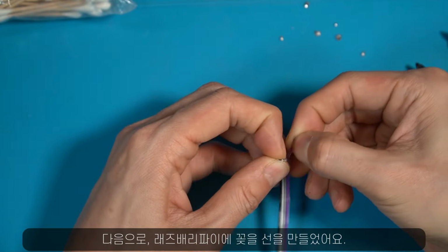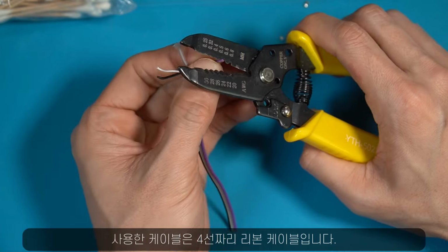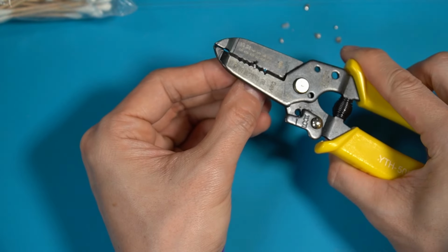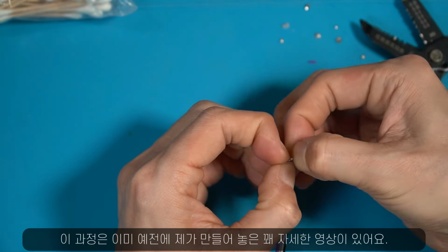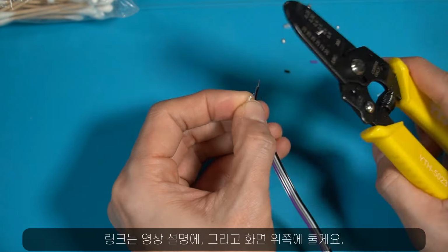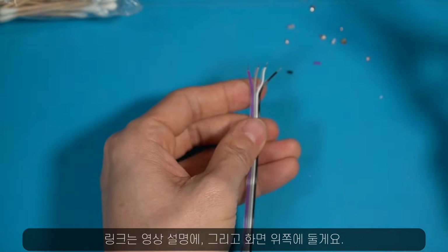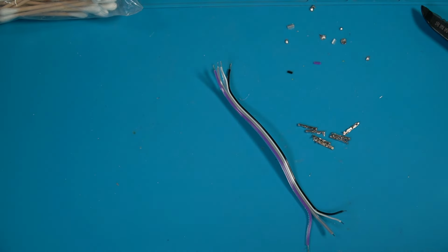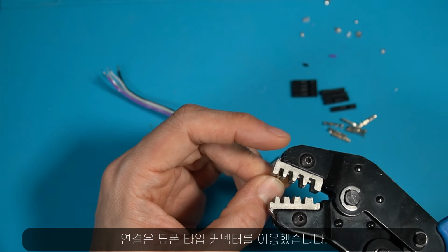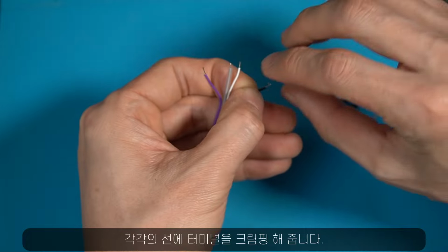Now I'm going to make the cable to make the connection to the Raspberry Pi, and I'm going to use this four-wire ribbon cable. I have already made a comprehensive crimping instruction video quite some time ago, and I'm going to leave a link in the description and as a link on the screen above. The connection is made using Dupont type connectors, and I have crimped terminals on each cable.